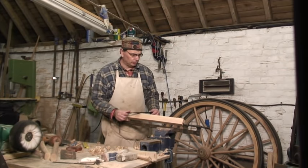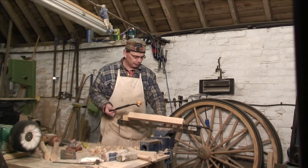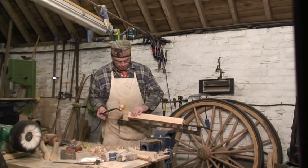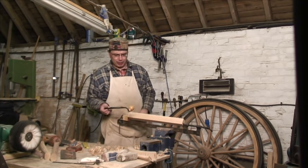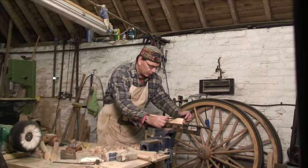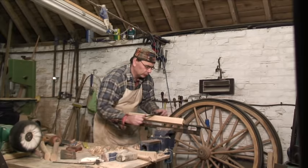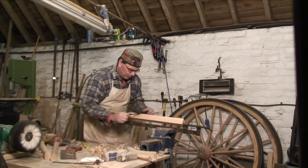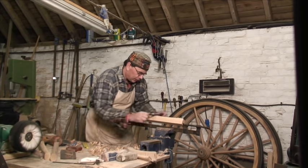Whenever I start making a wheel I like to start by making the spokes first. This is a piece of English ash — I bought it as a plank, cut it to length, it's gone through the planer so it's nice and smooth, cut to the right size, and I've cut the mortises on the end. Now I'm going to use a tool called a draw knife — this thing here — to get the basic shape. You work by pulling the knife towards you and as you can see it's taking quite big pieces of wood off, getting it rough into the shape I need fairly quickly.